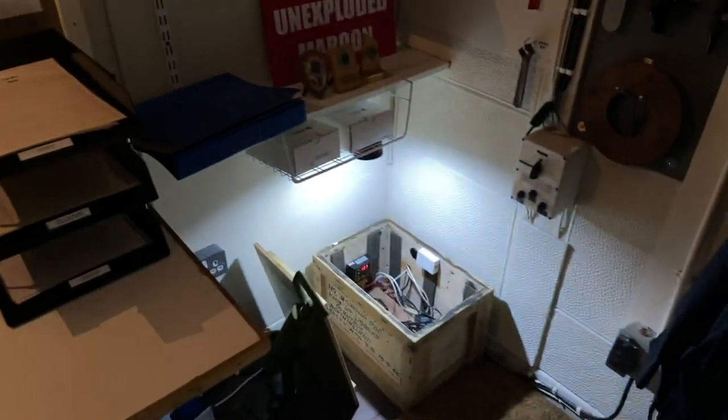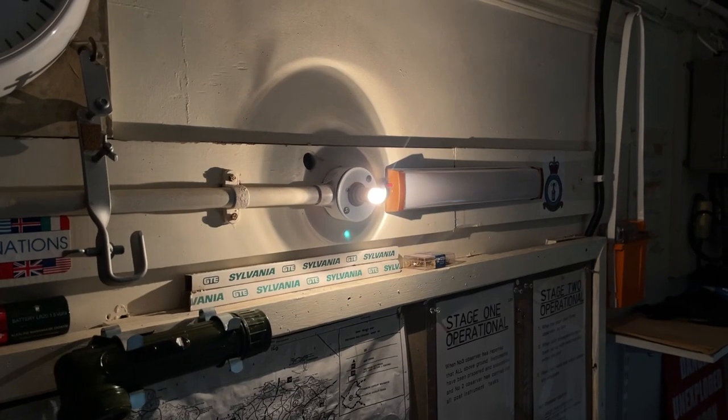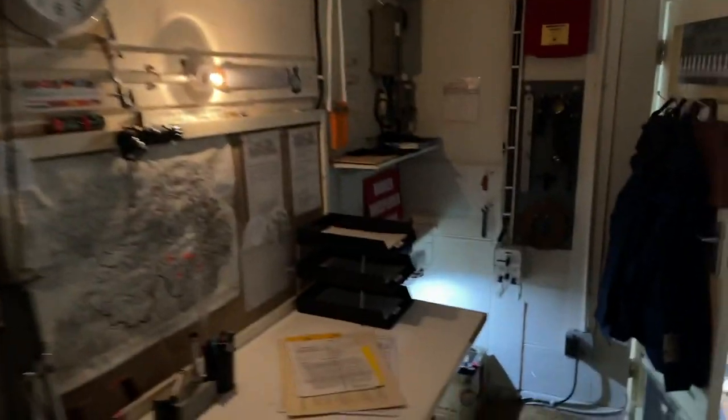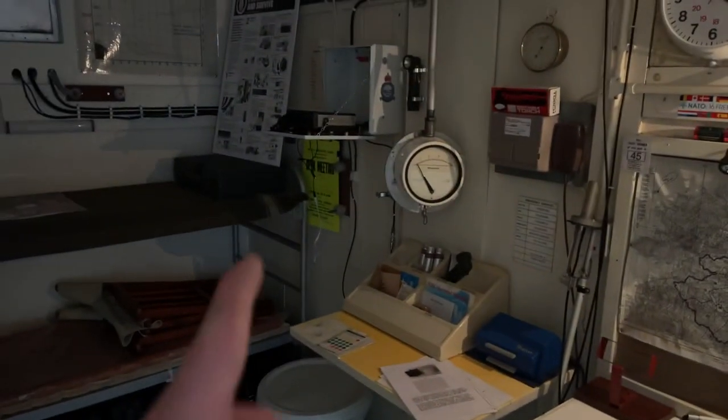I was right — it was a reversed polarity. So there you go. That small bulb would be your night bulb — you'd use it as much as possible because it draws the least voltage. There's a switch here so you can switch between options: you weren't allowed to have both on at the same time, it was either one or the other. There's the strip light on, then flick it over and there's the bulb, and over here are the controls for these lights and this light. That gives you all the light you need and keeps it authentic to what they would have used originally.